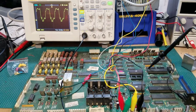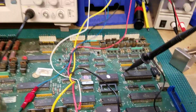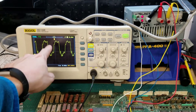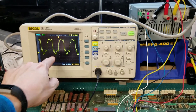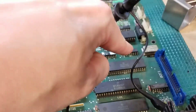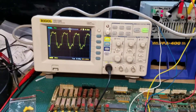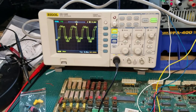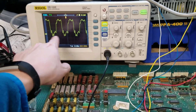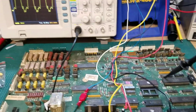Here's another example with the oscilloscope on the System 9 board. We're looking at pin 39 on the 6808, which is our clock. You can see here we have what you should see from a clock — this kind of oscillating type of signal. This looks to be a pretty normal, correct clock. If you know anything about these boards, you'll see the crystal down here. These crystals are not great and do suffer issues over time. But in this case, from the clock perspective of this board, everything looks to be good. If you have a bad crystal, you may see irregular patterns or lines pulled high or low.